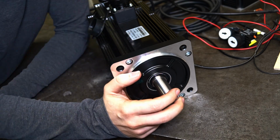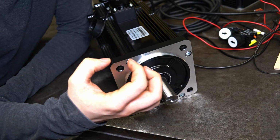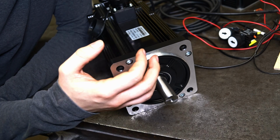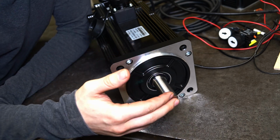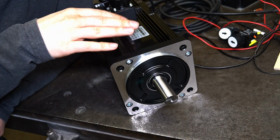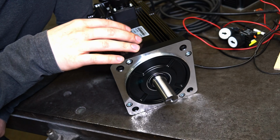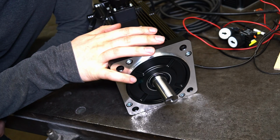For example, I'd like to have the possibility to rotate my part in the rotating chuck to the right position and then do some work on it in the angular position I just set before. And most of the Chinese servo motors have in their drivers the possibility to switch between the speed mode and the positioning mode. It is done just by one digital input.